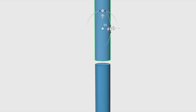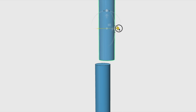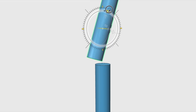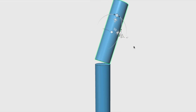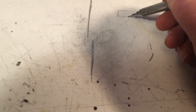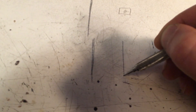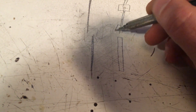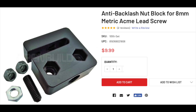Now just a small rant — some of you are going to try this and it's not going to work and you're going to get pissed off. Two possible reasons. Number one, you might have axial alignment issues that are really bad, as in the shafts are out of parallel with each other. In that case, align your printer first. These flexible couplers are supposed to deal with angular alignment issues, not out-of-parallel issues, but they can help a little bit. The reason is that these nuts have a little bit of play in them. So if your shafts are slightly out of alignment, the nut becomes your pivot point, and the coupler should be able to take care of the angular discrepancy — though only if it's fairly slight. That won't work quite so well if you use an anti-backlash nut that holds things fairly rigidly in the middle, but that's a subject for a different video.